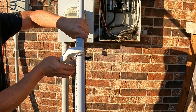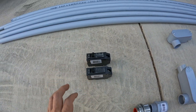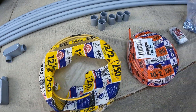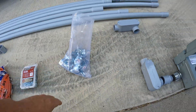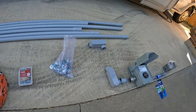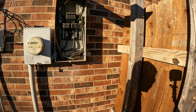I always say go a little bit longer than you should, so I'm going to go maybe about three feet. While I'm cutting this, I'll show you what Plan A was. These are all the materials I gathered up for the first attempt — going to throw in this 30 amp and 20 amp breaker into the panel, come out the panel with some metal, convert to PVC, connect, run under the overhang, put 12 and 10 gauge wire in the conduit, probably use couplers instead of quick connectors, come back down into the 30 amp box, then pass through and run a 20 amp GFCI. After showing this to a friend, he told me not to run Romex outdoors inside conduit — apparently it's some kind of code thing.